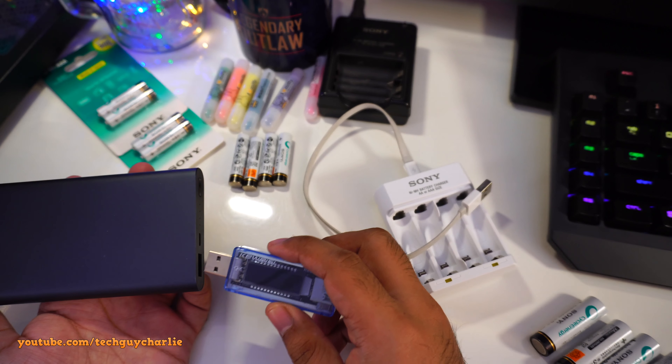Charging stops exactly after 15 hours. I unplugged the cable to run a test, but the batteries are still very hot. After 15 hours, charging is automatically stopped and the LED indicator turns off — these are the double A batteries, and they are really hot, suggesting overcharging occurred.